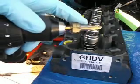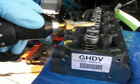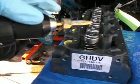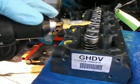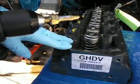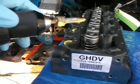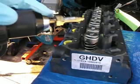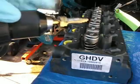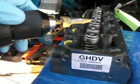This kind of acts somewhat as a guide — it's not precise at all, but with this job you don't have to be that precise. I decided not to use cutting oil because it just makes a mess with cast iron shavings. Also, this head is brand spanking new so there's literally no oil on it — any shavings just blow away with compressed air. If I put oil on it, it makes everything a mess, and I want to paint these heads so I don't want to clean up oil later.